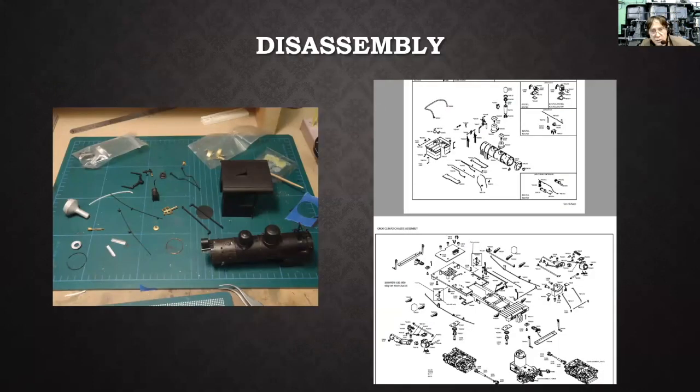On the disassembly stage, this applies to a die-cast Bachmann model, which I think most of them are typically the same. They provide on their website an illustrated parts breakdown of all their locomotives, so you can download a PDF file as a reference as you're tearing things apart. A lot of the little doodads and parts are just kind of glued on there, so if you've got a number 11 X-Acto blade or some dental picks, you can pop things off fairly easily without breaking things. This picture shows one of the stacks I was experimenting with, plus a whistle casting and some nuts and bolts.